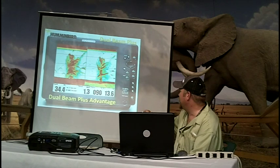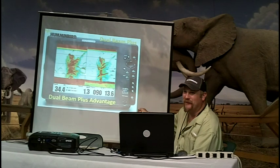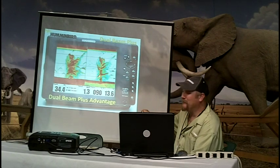The big thing to look at is you've got fish here and here. Look at how much more of that fish shows up — this one didn't even show up, and those three didn't show up over there. This is the 20 degree cone, so in 34 foot of water we're looking at about 10-11 foot of coverage here, and 34 foot of water over there.